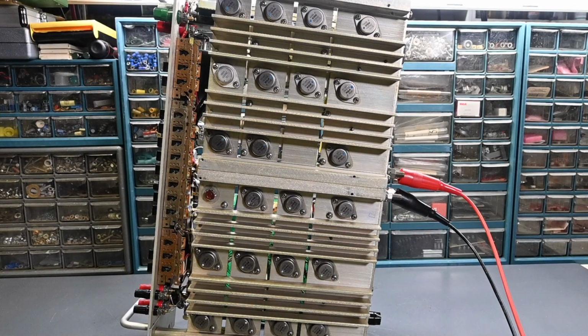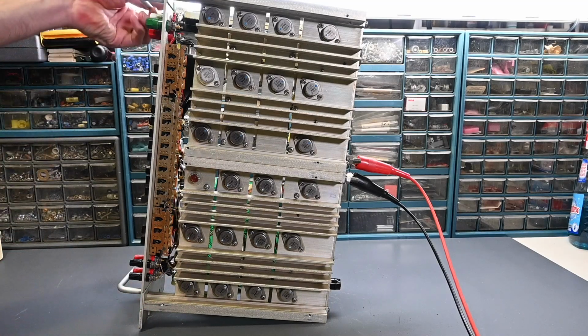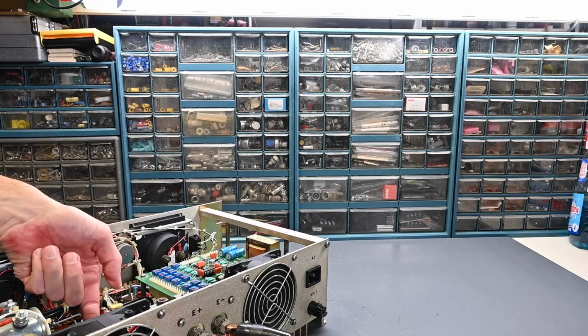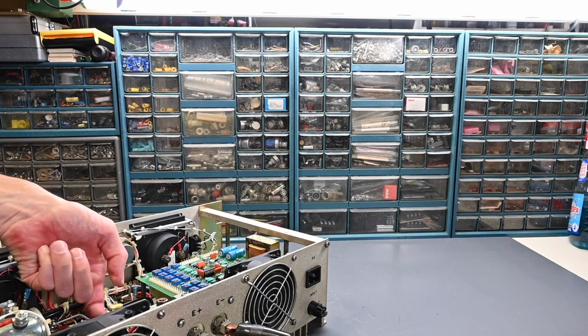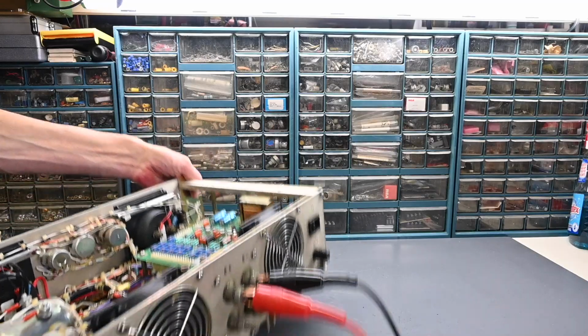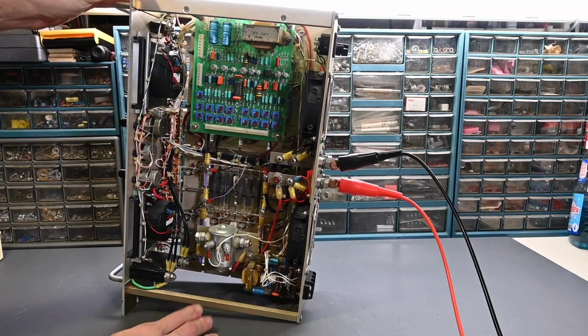So I've shut the power supply back down. I can smell something, that warm, kind of old electronic smell. So I'm wondering if maybe it's a resistor or something in here. Don't really feel anything. The current shunts are mildly warm. Really not much going on there. Nothing major. Oh yeah, so I'm going to turn this here. There's an emitter resistor on that same transistor.